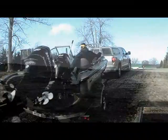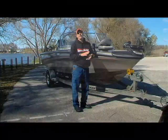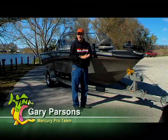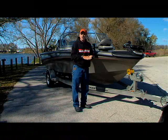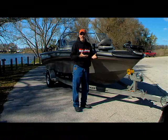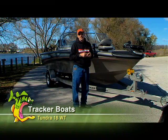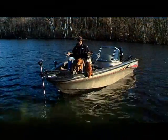The question is what do you look for in rough water performance in a boat? The truth of the matter is fiberglass boats have a hull shape that allows for a little bit drier ride and a little bit smoother ride. Aluminum boats allow for a better hole shot, and that's really important when you're trying to traverse big waves because the boat will be a lot more responsive compared to the sluggishness that a glass boat will give you. So what you'd really like to have is an ideal boat that would have both characteristics.